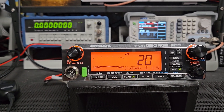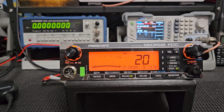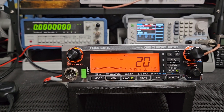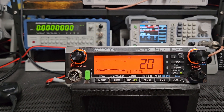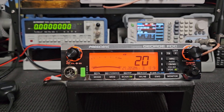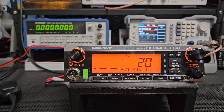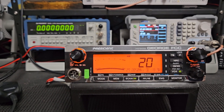It does not help you whatsoever. Even if I show it a hundred times, you really need to sit here and see radio after radio do the same thing — because by over-adjusting the modulation circuit, it's going to happen with every radio, every time. Some are horribly worse than others, but they all do it to some degree. And if you give yourself the best antenna you possibly can — financially, geographically, whatever — you can totally destroy all that by just over-adjusting the radio.